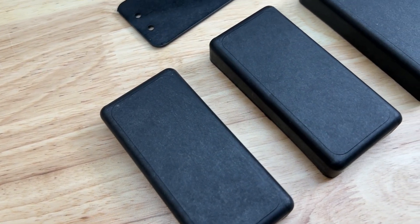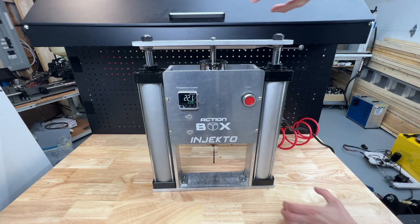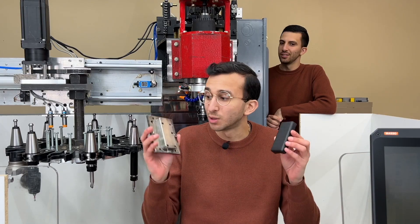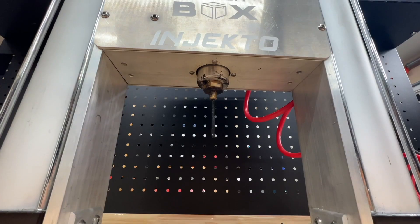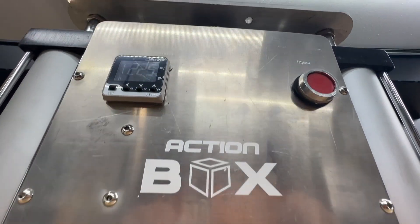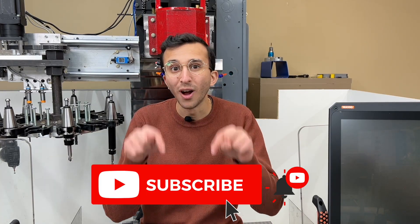With another successful run, we've been extremely happy with this tiny desktop size plastic injection molding machine. But is it perfect? No. Our main issue is that it can't produce enough pressure to inject molds larger than this, although quite honestly this is already a huge mold to inject. Although there are many design aspects to improve on, this prototype was sufficient as proof of concept and the end results looked promising. We plan to iterate on this design and create a bulletproof concept that we'll make available to all you viewers. Subscribe and share the video if you haven't already — we'll see you next time at the Action Box!